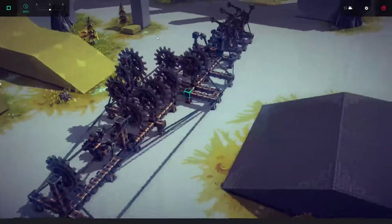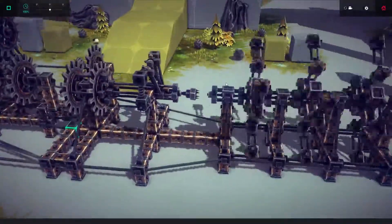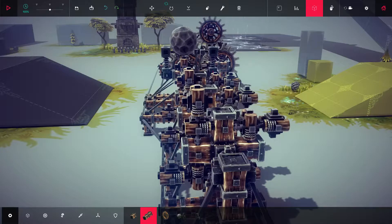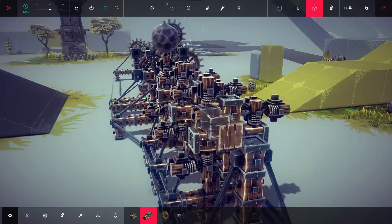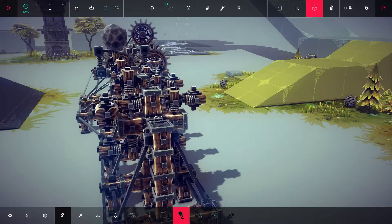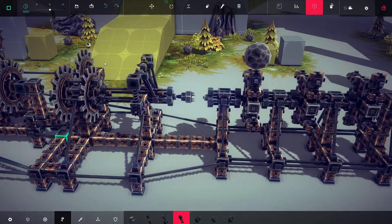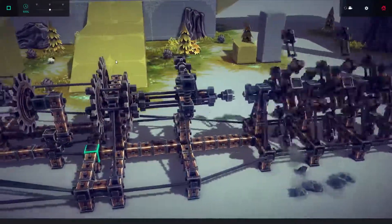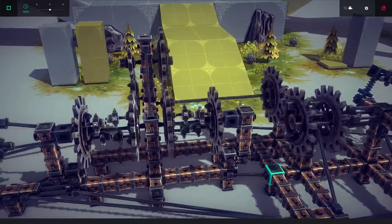Let me start it up. So you have the engine turning and it starts spinning up really fast. The way that these look — they do look like swastikas, but that is not how they were intended to look. Basically, I found that this provides almost twice as much power as instead of having them linear. So instead of having them one way, you have one and then the 90-degree one perpendicular to it — it does produce a fair bit more power. So you start that, it goes, does its own thing. The engine is basically running. Now you engage the clutch, the grabber grabs on, it spins the flywheel, it spins the alternate gears, and then spins the main gears.